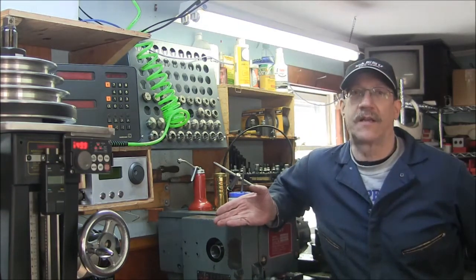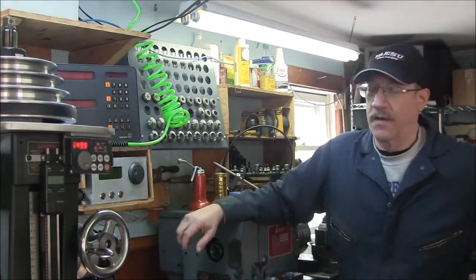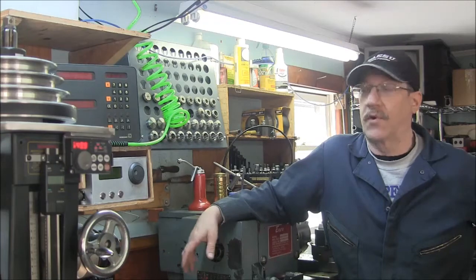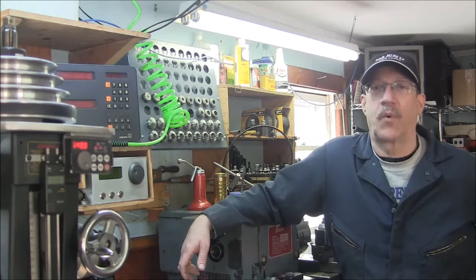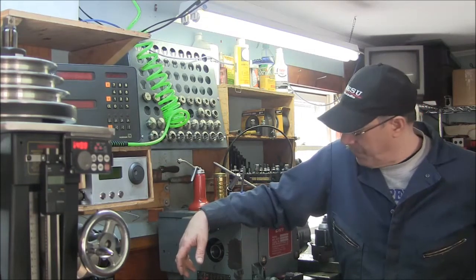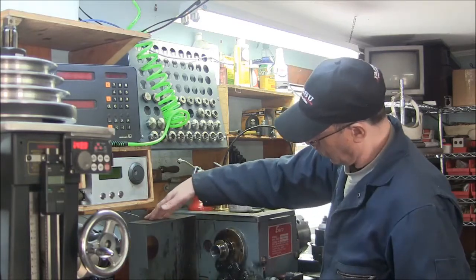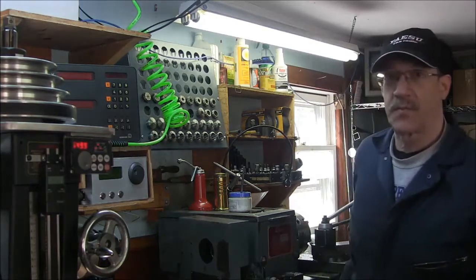it has to stick out the end of the lathe because the headstock's only like 15 inches long. And it can get kind of dangerous with the smaller diameters, sticking out here, 1.5 foot. They can get to whipping around if the only place that's holding them is at the chuck. So I'm going to show you what I have done in the past and why that doesn't work, and then we'll get to cutting some metal here.